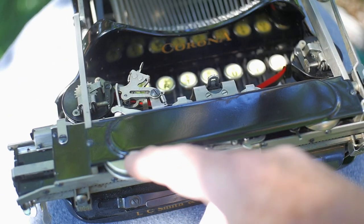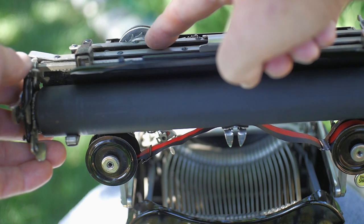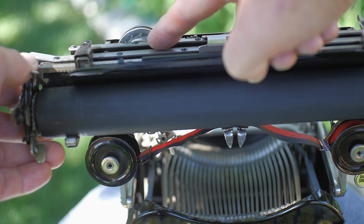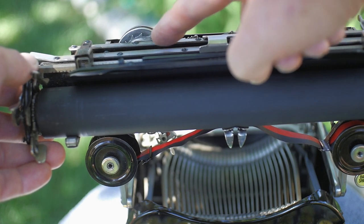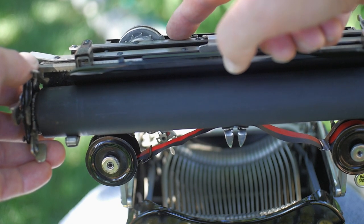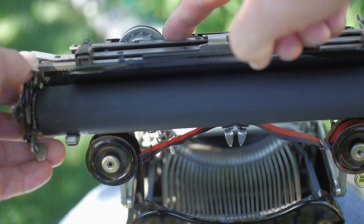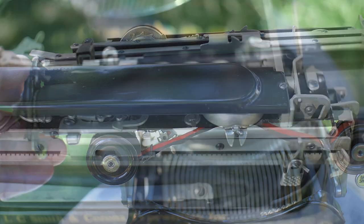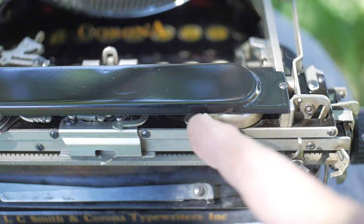The spring motor is right here. You can use a thin screwdriver to advance the spring action and increase the spring tension by pushing to the left on these keys. You can also manually pull this lever to reduce the tension — just be careful when doing that. And it has a nice, sweet-sounding little bell.